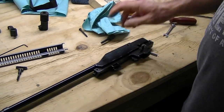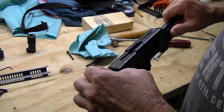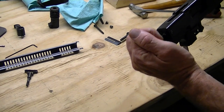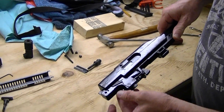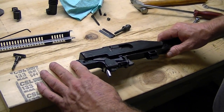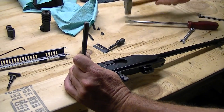Okay, this is the part that's different. It's our breech bolt right here, this top part. The newer ones — well, even most older ones — have like a clamp, like a sliding lock, kind of like a clip. On these old Gen 1 ones you've got a roll pin right here you have to knock out — right there. That's basically why I wanted to do this video, because it's different. So I'll get my punch and we'll hammer that out.